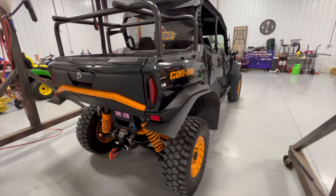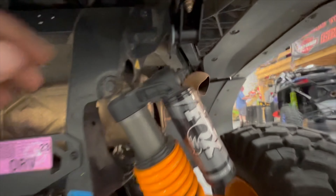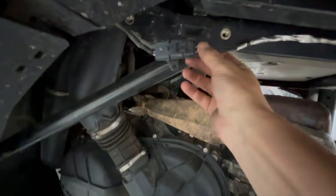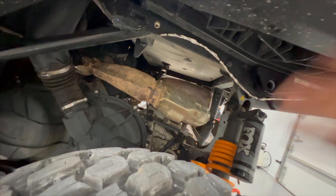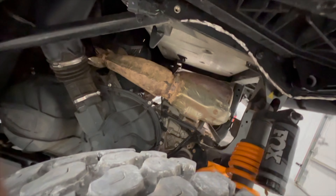Okay, it's already back on. It's super simple. You literally have four bolts — one here, one up here, same on the other side. On this side, do recommend pulling this cable, popping this, pulling these little plastic plugs out, lifting it straight up. Or if you have someone to help you, two people can pick this bed up, put it on a set of sawhorses, swap these out, put it right back on.